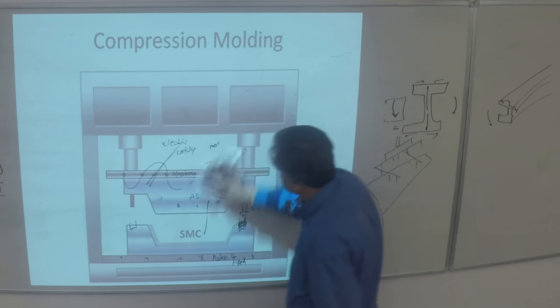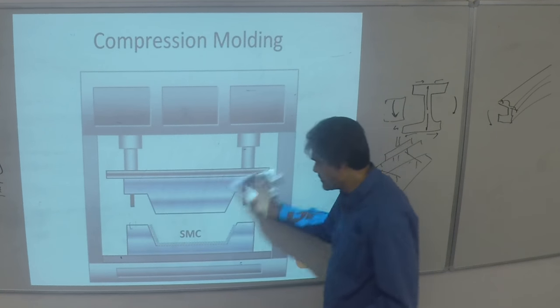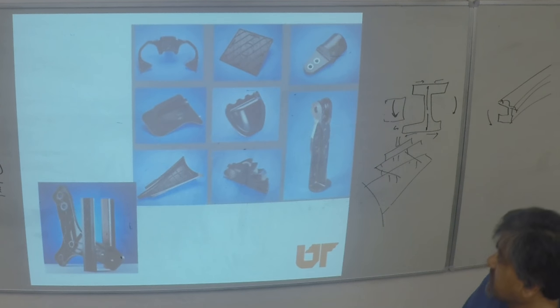Tooling material classes for compression: you can go with aluminum for limited production — up to about 5,000 parts for 24×24 inch size. You can go to steel at different grades, or to cast aluminum or cast steel. There's a whole body of tool makers who specialize in one or the other.